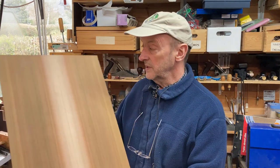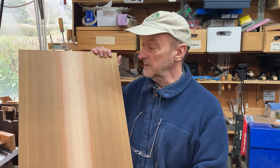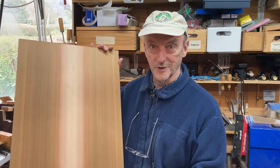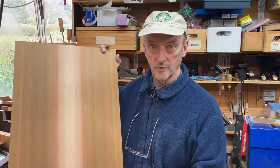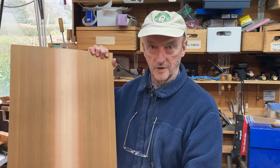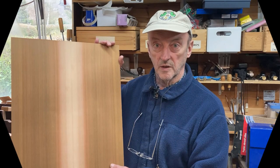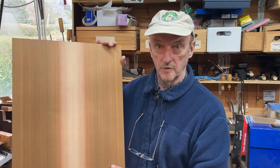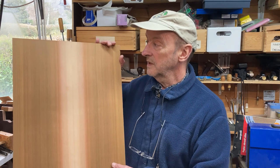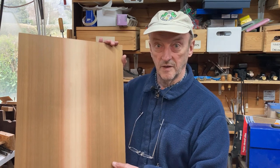The piece of wood I chose for the top is this rather unusual looking piece of sinker western red cedar. It's 'sinker' because it's obviously been laying at the bottom of a lake or a bog for a period of time before it was sawn up and dried out. It's got a rather unusual pinkish stripe down the middle which is quite striking. It's got terrific straight grain and importantly a wonderful tap tone with great sustain — goes on for ages. I think it's going to make a lovely top.